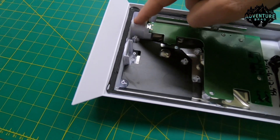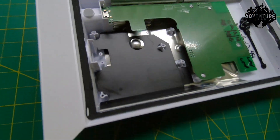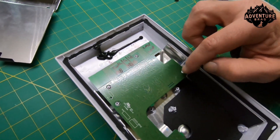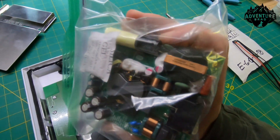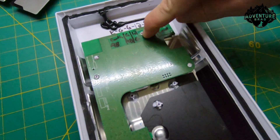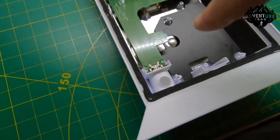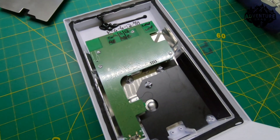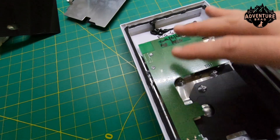I could save all this reinforcement and heat dissipation they've designed — the little pads match up, it's happy and snappy. Back to the AC-to-DC board: the screws are recessed. I drilled them out with the same size drill bit, then took a larger one — probably three-eighths of an inch — put the drill in real slow, and they all just grabbed and twisted off. That saved me from having to dig around against the PCB.